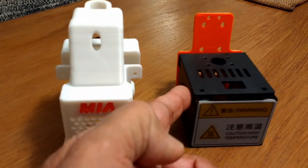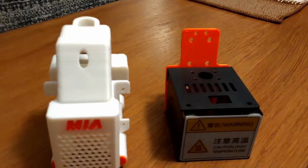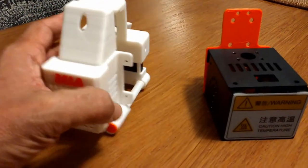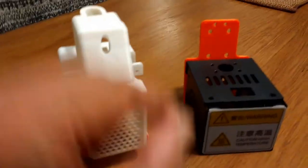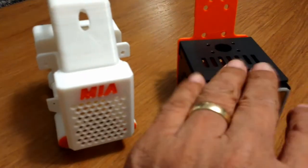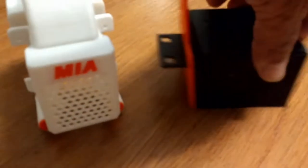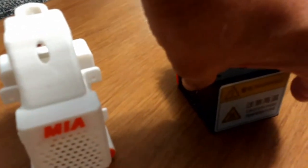It's the pros and cons of remaining with the stock hotend enclosure or system. This doesn't have the hotend in there because it's on the machine. I took this out to go with a fully 3D printed assembly here. This is my own design and I came up with several iterations by taking measurements of this plate right here. In fact, this is a 3D printed plate of the original metal plate on the Anycubic i3 — the cover and the hotend support. This is an L-bracket that goes to the back with provisions for the belt support as well. The belt is simply wrapped around those tabs and attached with tie wraps. That's how they do the Anycubic — very simply and very effectively.